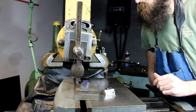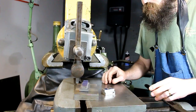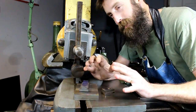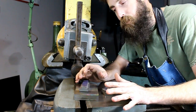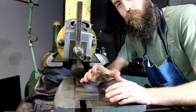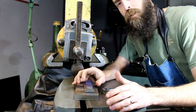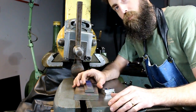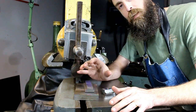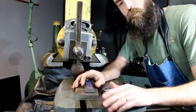And one of the common things that I see and do a lot of times, and I'm trying to get out of the habit of it, is when I machine something, I want to make it exactly fit the slot that it's going to go in. But it's just not necessary with a T-nut. You're dealing with slots that are probably going to have small chips and stuff in them, and you don't want to hassle with them being so tight that you have to force them in or wiggle them and whatnot. I'm going to make these to where they slide in the slot effortlessly, but still engage the vast majority of the contact area that they need to in order to be strong.